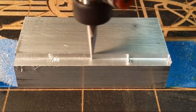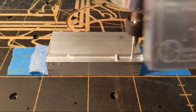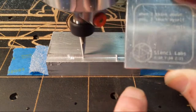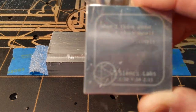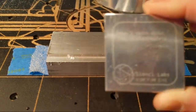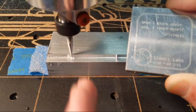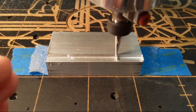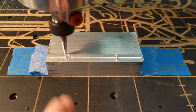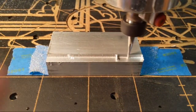I gotta get paper and pencil. But maybe I can try it with this. On a climb cut that's formed like this, it comes in and cuts the chip away, and the next cutting flute is already coming in for the next edge here to make a cut. So it's kind of like cutting the cheese, if you will, right? You're shearing away a piece of cheese. This doesn't smell as bad, but it's coming in, shearing it from the flat edge of the cheese, and it's always leaving a clean edge.